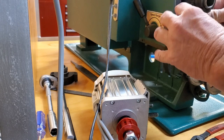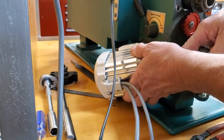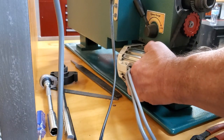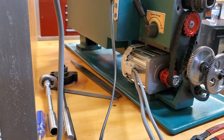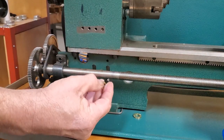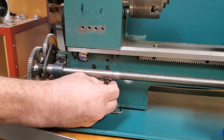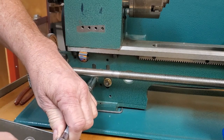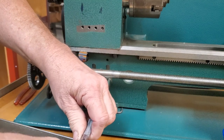With the motor ready to go on, place your belt in place. Take your motor mount — still loose — put it in the belt, and line up the holes for the mount. Come around the front side, throw on the washers, spin on the nuts, snug them and back off about a quarter turn just so it can slide.